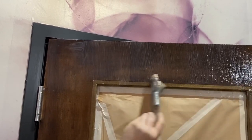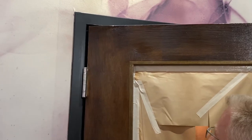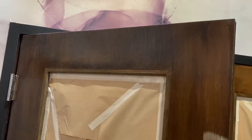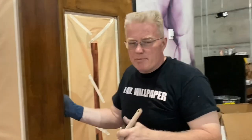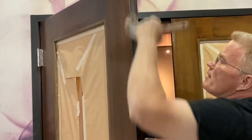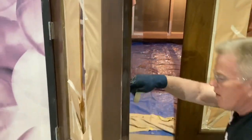What I'm doing here is going in the direction of the wood grain as I clear coat. You can see it's an up-and-down grain. I've gone side to side just to push that poly coat into the grain of the maple finish, but when I finish, you can see me stroking the brush and the urethane in the direction of the wood grain — very important. If you cross it, you create roping, which is a visible manifestation of brush marks that make the polyurethane dry in what looks like little ropes. Go in the direction of the grain so the eye doesn't notice any highs and lows.